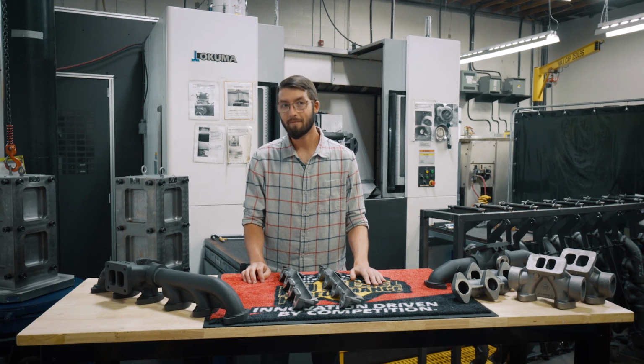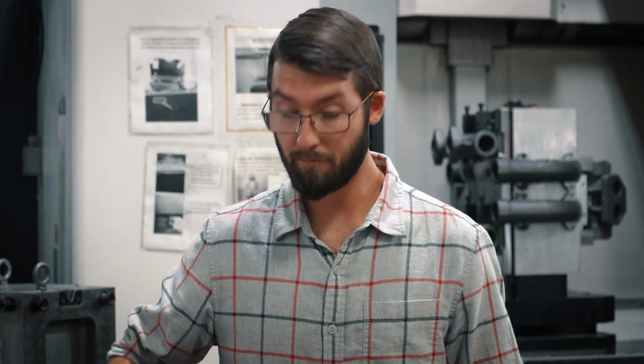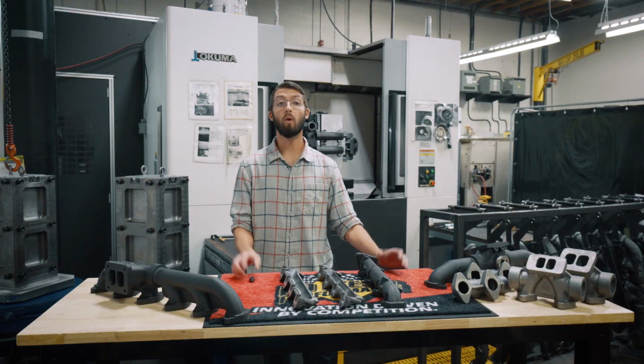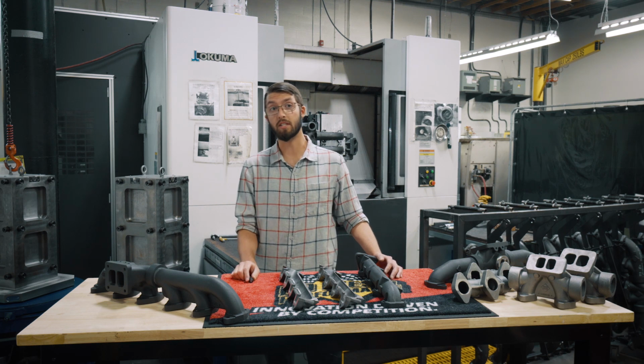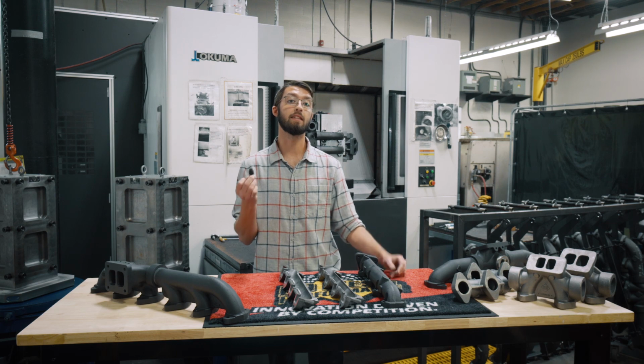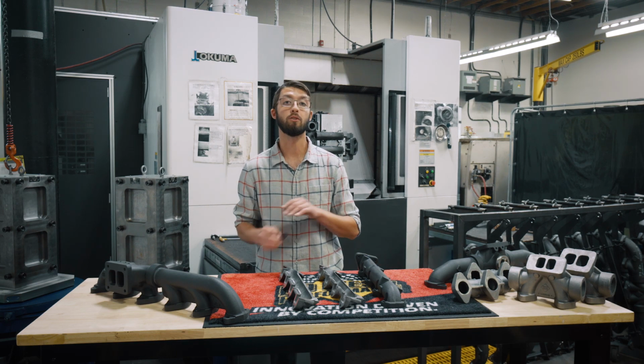Speaking of durability, have you ever driven a new Ford? Boom, new 6.7 Ford manifold. On the stock one, the biggest thing that fails is actually the stud. This little guy right here. When they break on a stock manifold, you'll notice this by an exhaust leak around the manifold itself. And what's happened is that stud is no longer able to hold the manifold to the head.